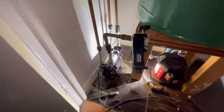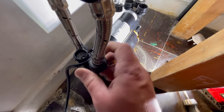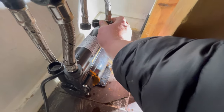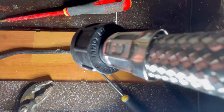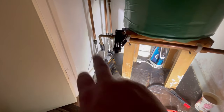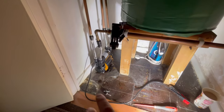You can shut those off and the pump is isolated — it can't run past. Also if you look inside you can see there's a non-return valve in there on the outlet. I tend to do these up hand tight, then I'll get my grips and give them a tiny little nip up. Hand tight only — you shouldn't really even use the grips. Make sure you don't void the warranty by leaving teeth marks and over-tightening it, because it's plastic threads and plastic nuts.